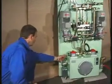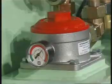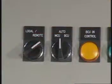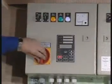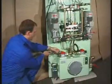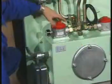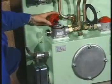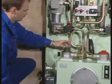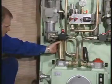If the hand of the pressure drop gauge points to the red area, the suction filter must be overhauled. This can be carried out while the pump station is running. Stop the pertaining supply pump and switch off the electrical power supply. Close the valve in the suction line and dismount the suction filter cover. The suction filter housing has a built-in cut-off valve which automatically stops the oil flow to the housing during disassembly. Remove the filter insert and fit a new one.